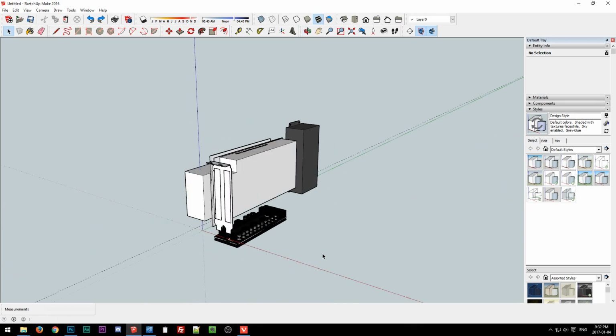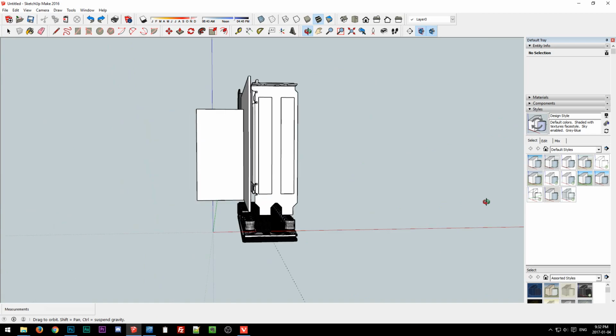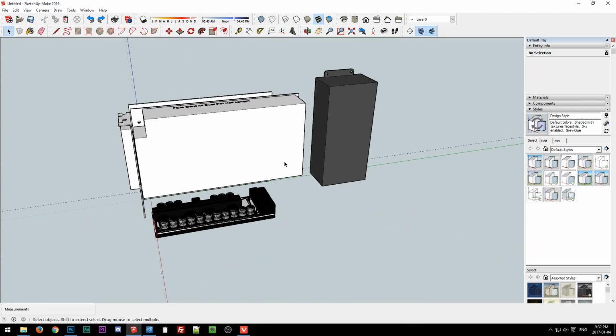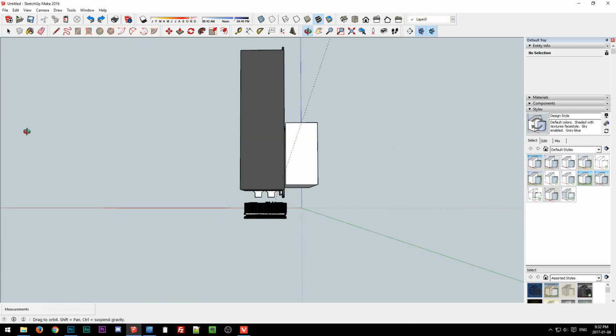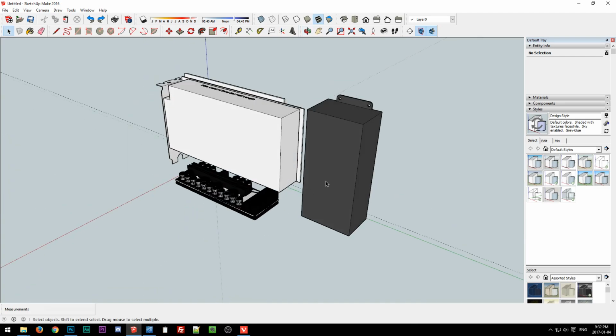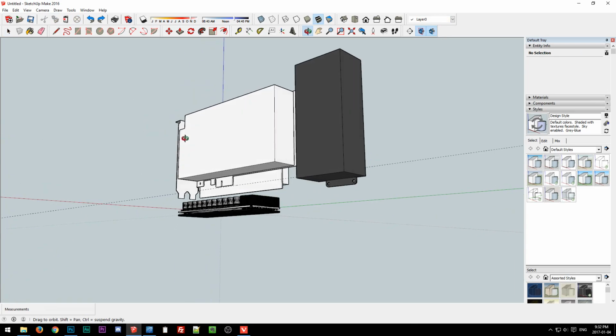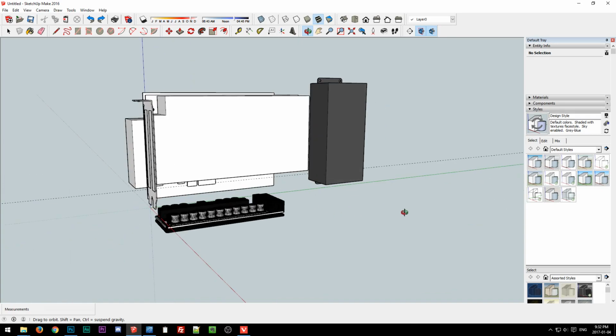But anyway, as far as making it a bit wider so they can fit at the bottom, the problem is there really isn't room for it unless we make it twice as wide, which is kind of pointless because we still need the depth here for the video card. So there's really nowhere to put it. Oh, unless, yeah, if we did do the Pico PSU, we could put the AC/DC down here and put the Pico basically anywhere, since it's not very big. But then we're relying on that one unit.